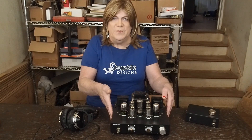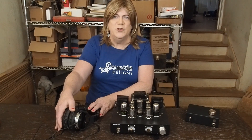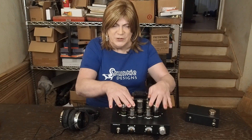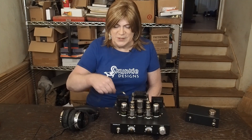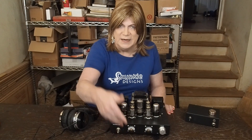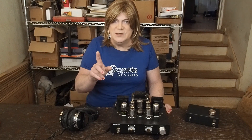Hey y'all! One of the questions I get a lot is: I've got this tube amplifier, I've got these headphones — how do I listen to this with these? Unfortunately, the way a tube amplifier works with the high voltage, high impedance output tubes, and the low impedance output using these output transformers and the high voltages involved, you can't just hook this up to this without some extra circuitry. I know they make one of these that has a headphone jack in it, but most of these tube amps don't. And there's a reason why.